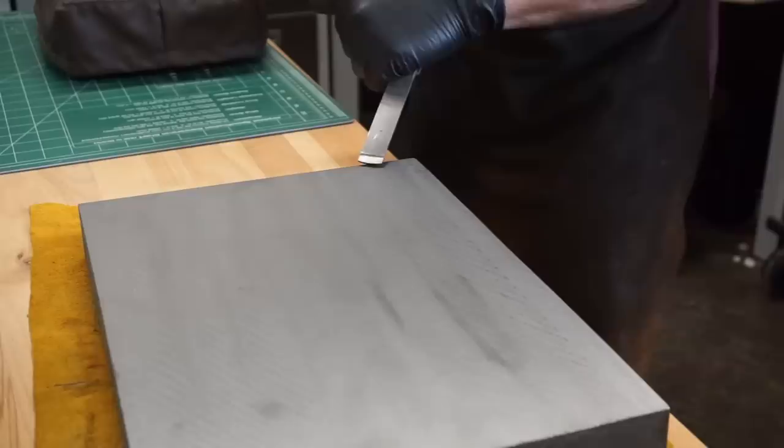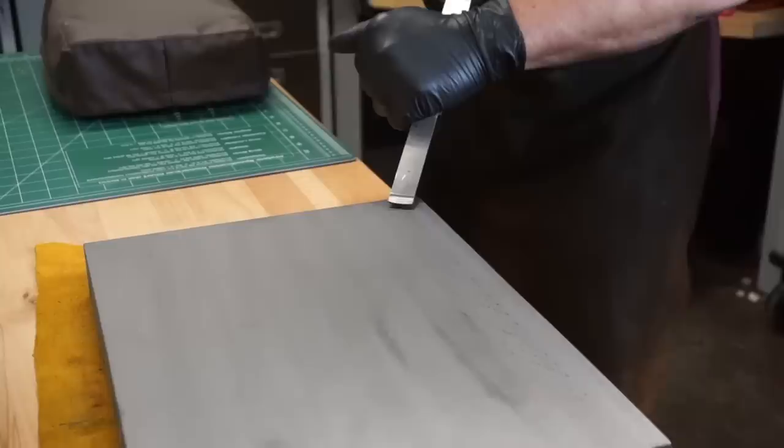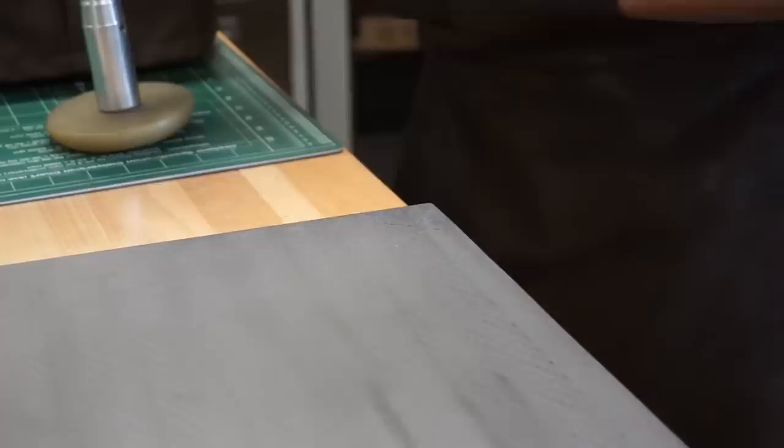But I'm comfortable scraping. Basically, if I was roughing, I would be taking 5/8 to 3/4 inch cuts, 2 to 3 times wider than this with a bigger blade, if I was really trying to get some material down so I could get it in one plane. Right here, I'm in that in-between stage. Let's assume we've measured this. Can you get close up on those?